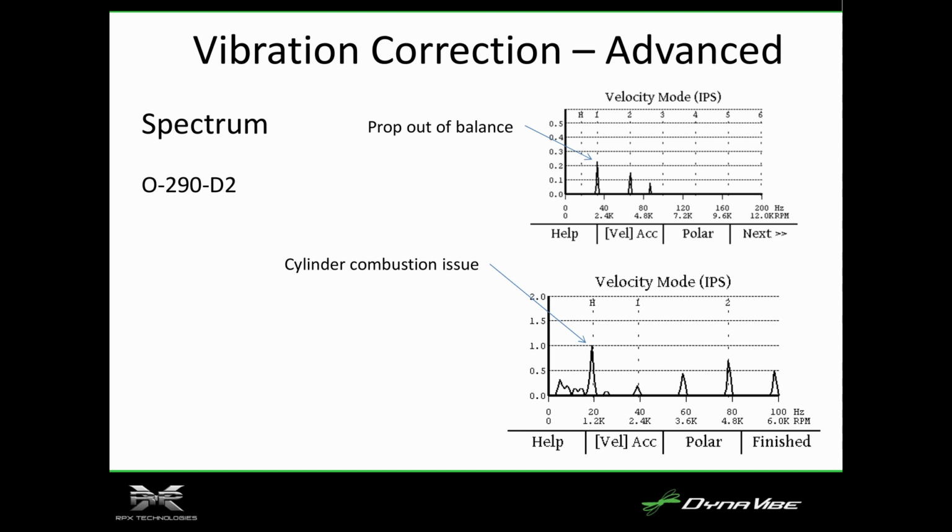So there's amplitude modulation, which we see very, very rarely, and it's usually because something's binding up. You'll get what's an amplitude modulation, and it will show up as little shoulders on the side. This may have a very small hint of it, but these little shoulders on each side of the peak. Normally you'll also get a beat frequency, which this system will separate out into individual bins.